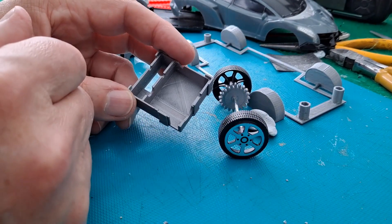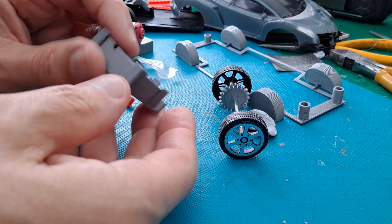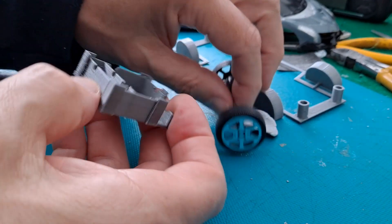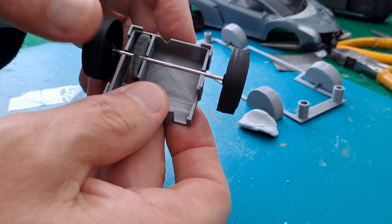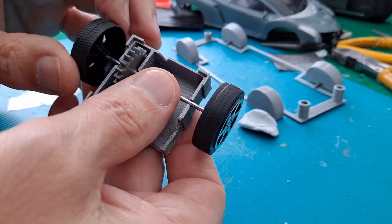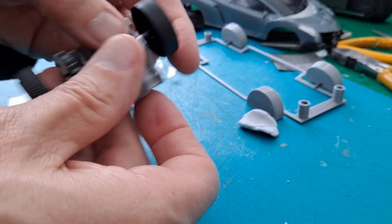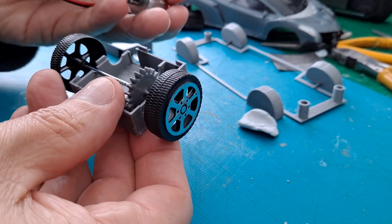Still, we can fix that quite easily. That seems to work. I haven't got any proper bearing surfaces — just holes in the plastic — which will last for as long as I need it to. Ideally you'd have little nylon bushes there, or even ball races if you really want to go that far. Yeah, that seems to fit together.